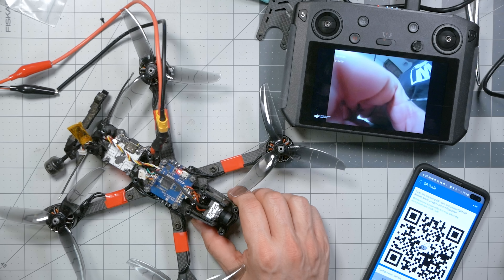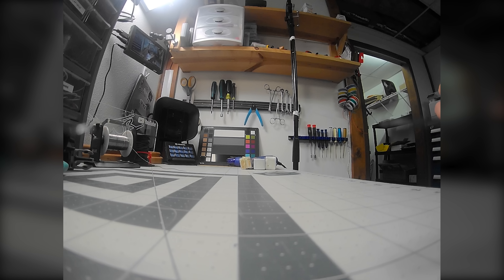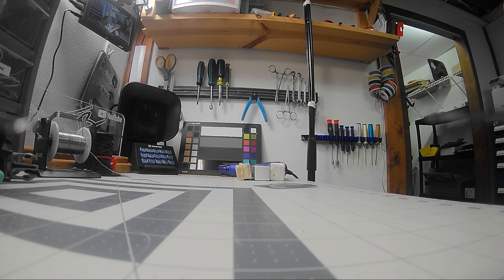On the DJI smart controller, you can see the image coming from the Split HD is in 4:3 aspect ratio. This is a 60 FPS camera, and all other DJI 60 FPS cameras only operate in 16:9. This one not only records in 4:3 but also transmits 4:3 back to the goggles when set to 2.7K 4:3. It appears to be a native 4:3 sensor — look how much vertical field of view you're getting. In 16:9 mode the field of view is cropped down. This is the only 60 FPS DJI camera that can do that, which does mitigate one of the downsides, but not the major one.